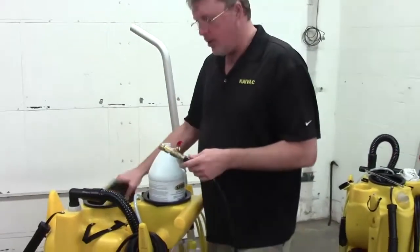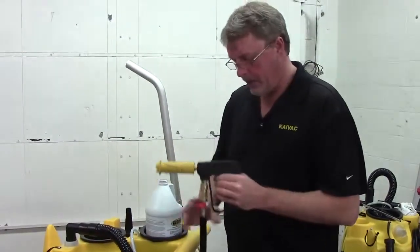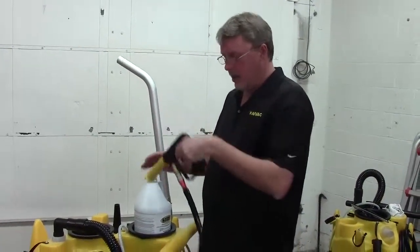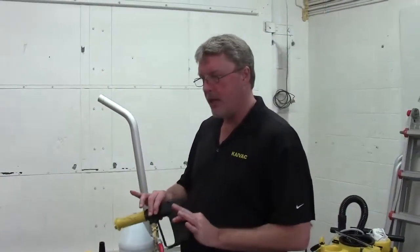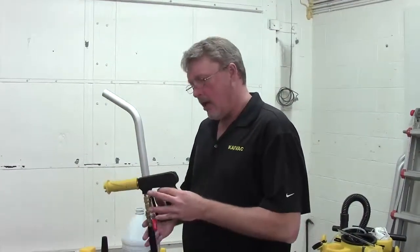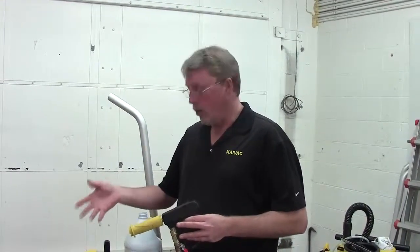So we're going to then do the same test, but we're going to put the gun on, and we're going to put the gun in low. Turn on your valve and do the same test with the gun in low, 60 seconds, and the two should be the same. Now, if they're not, it could mean that you got some mineral buildup in your gun, some blockage has gotten through somehow and is clogging your gun, because we're getting a gallon per minute here, just not from here. It could also mean that the seals on your pump are bad, or even that your regulator, even though we just did that regulator test, is just not quite sealing.